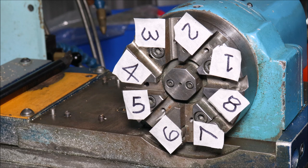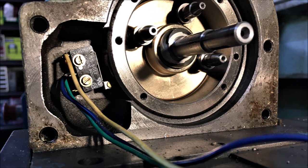In fact it's saying it's on tool 8, which would have been the previous tool. That previous video was actually made so that I could send it to an expert on the Hercus, so that he could try and give me some idea what was wrong with it. He suggested firstly the micro switches not being correctly adjusted.